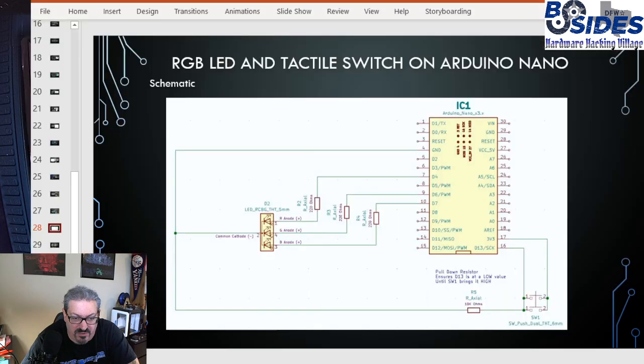So we'll start with our design. Lab 2 is focused around this particular circuit using a red, green, blue LED. This is the circuit schematic. You'll notice that in the schematic, the RGB LED is shown as 3 different LEDs because it actually is 3 different LEDs built into a compact form factor, sharing, in this case, a common cathode, the negative line. So that's why the device has 4 pins on it.